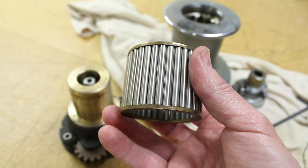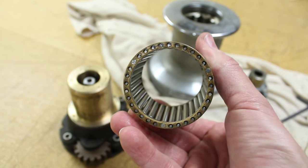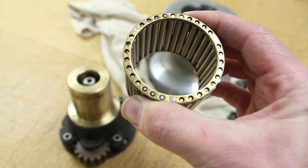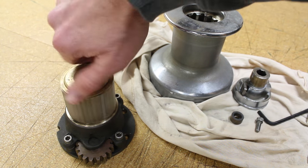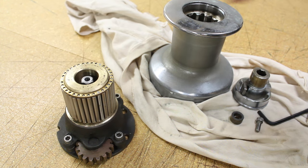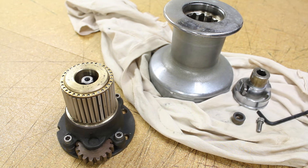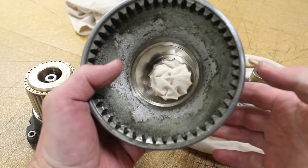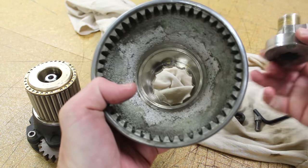The bearing assembly should be lightly greased with a special winch grease and then placed back on the spindle. All of the pawls should have a light dab of oil, but not a lot of grease or a heavy grease because that will gum them up and then the pawls won't work. For the pawls, less is more.